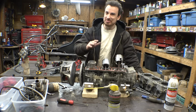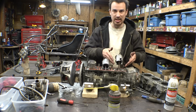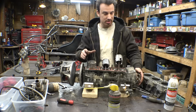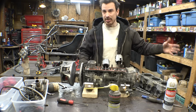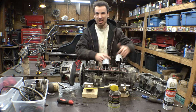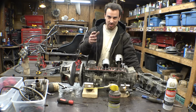But there is a slight possibility that that did happen, but if it did, you'd think that I would see shavings in here and also be able to hear the bearings being crunchy, and I don't see any shavings, I don't see any pieces. I looked in all the cylinders, I'm spraying carb cleaner, I'm checking everywhere, and I don't see any shavings, so I'm just going to take that as an assumption that the piece somehow magically exited the engine without causing any other damage,